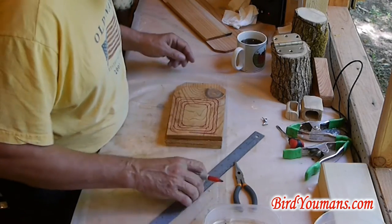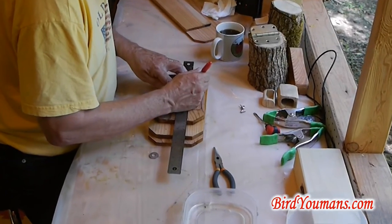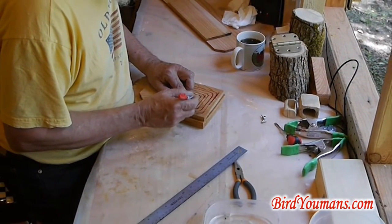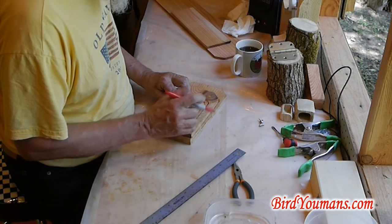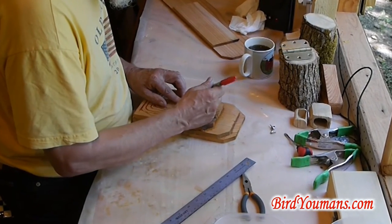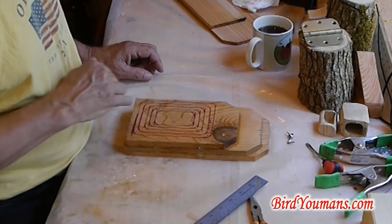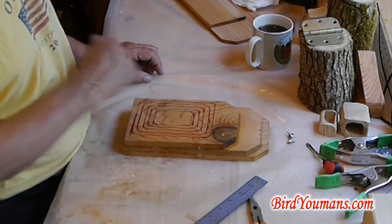I'll probably dream of it — I think I can still get one more out of that. I'm going to let it rest after this one. One tip: find out how tight a radius your bandsaw blade can cut, and then use the appropriate washer size to round any corners you have to round over. You won't have to struggle with those corners. I'm going to stop there — so one, two, three, four boxes. Out of that we'll just see what happens.